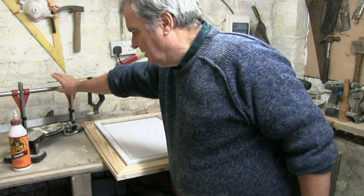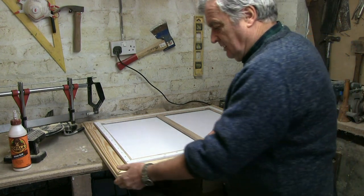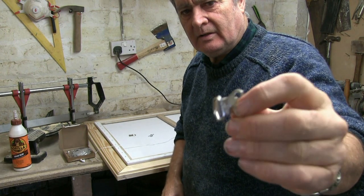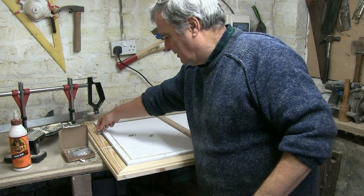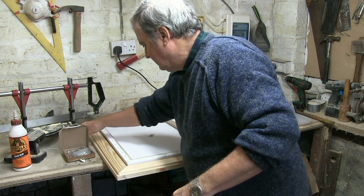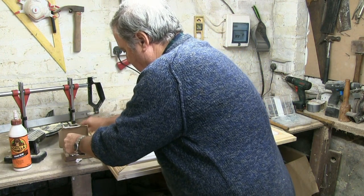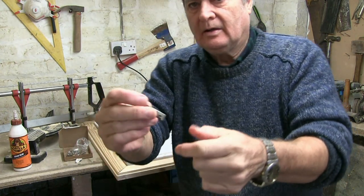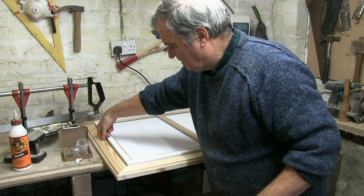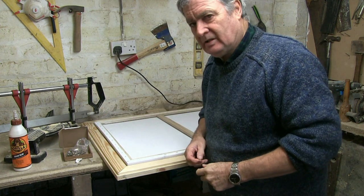The only tools I've needed have been this mitre saw, a jigsaw, little hammers, and panel pins. That's it really — a bit of sandpaper and I'll finish in a minute. Now I need to put the clips on. What we're going to need to finish off are two little D-rings — these little fellas — and the screws that go with them. They're going to go on the edge of the frame here for the string, with a bit of braided nylon. I also use these lovely little spring clips. You screw them down and they tension down onto the painting, so if you ever need to move it you can just twist those around and your painting comes out very quickly and very easily.